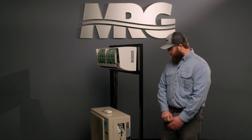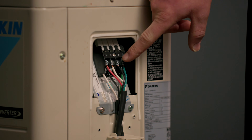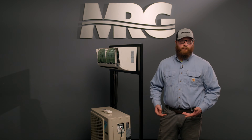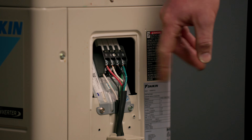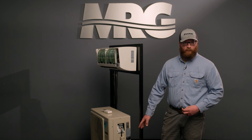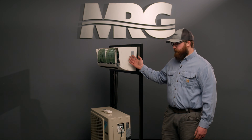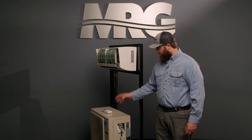It's very important to match the wiring on the inside because terminal number three is not line voltage — it's actually DC communication voltage, anywhere from 50 volts DC to 150 volts DC. If we hook this up on the wrong wire, we can have problems such as PCB failures and equipment just not working. Terminals 1 and 2 are just line one and line two, so that's AC voltage — each line is 120 volts to ground. We're taking line voltage and passing it on terminals 1 and 2 up to the indoor unit to power it.